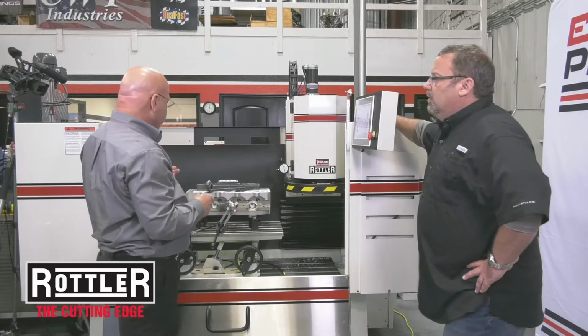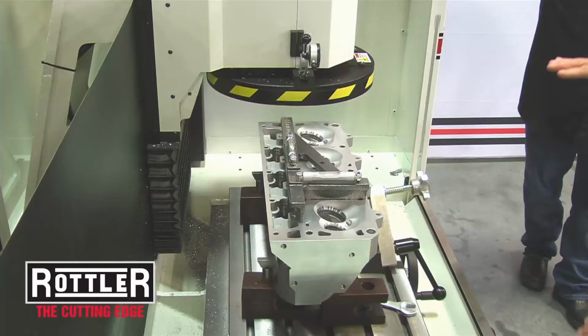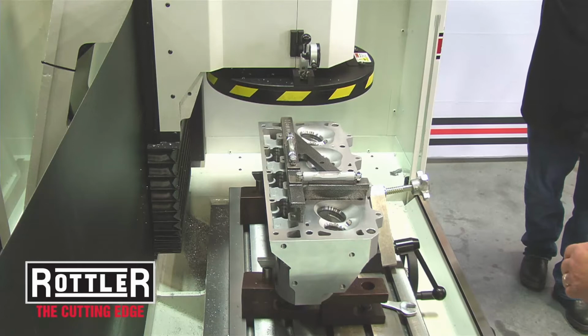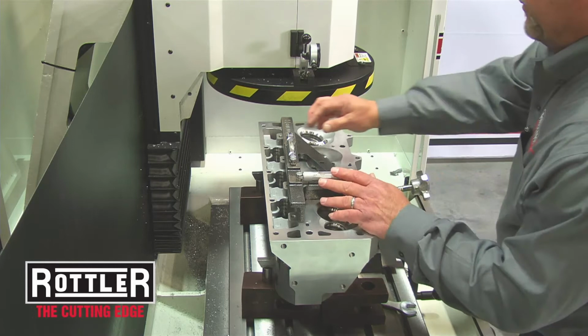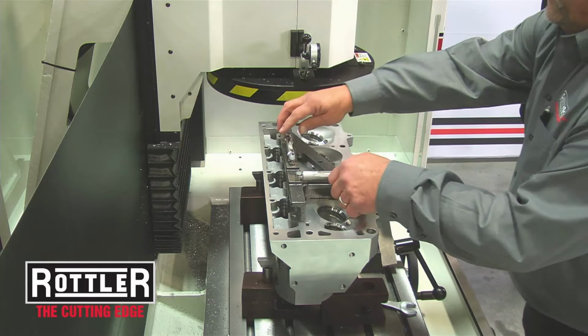We're going to guide it up in here. The table actually has a couple of handles here. One of them pivots it front to back, another end to end, so that we can get her leveled. Okay. We've got our level up on here, and with the handle unlocked over here, we can pivot it, get it set. Got it all set.